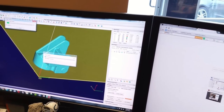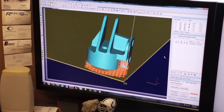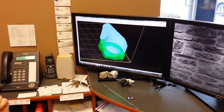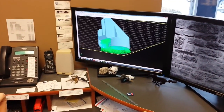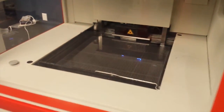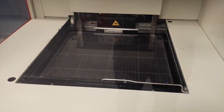Our quick cast process starts the same as any other 3D printed rapid prototyping project. First, we begin with a workable as-cast 3D CAD model of the pattern. Typically, we will then scale up the model by a client-provided shrink factor. Next, our expert staff and specialized software come together to process the data and produce an SLA machine-specific file. This file is fed to the SLA machine and produced layer by layer.